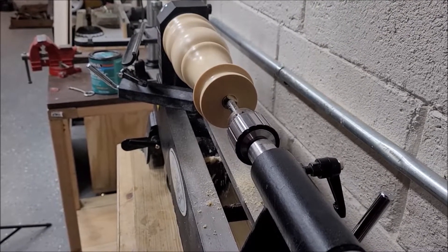Once those four coats dried, we took a Forstner bit and put a shallow hole right at the top just to seat the base where the bulb's going to go. Sometimes on the lathe these things get locked in pretty well, so you have to use the tool and a wrench to get them off. We made sure to be extra cautious taking it off — we didn't want to put any dents or scratches in it by accidentally dropping it.